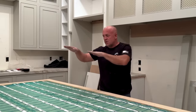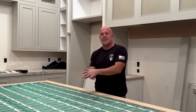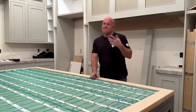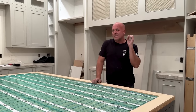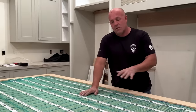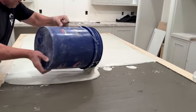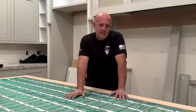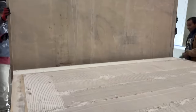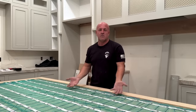We used two layers of half-inch plywood going across, and we staggered the joints so that we wouldn't have mud sneaking through or dripping through the seams. Then we ripped a four-inch strip and put it around the top, so this edge is now a full inch and a half thick. That worked out perfect because the granite we're using is 3 cm — we're doubling the edges to 6 cm, so an inch and a half is great. Now we need to put in a non-shrink grout, float this with concrete for thermal transfer. This is a giant solid slab of granite, and I need a good thermal transfer, so I'm going to set the granite to this non-shrink grout base so we have direct cement-based product to cement-based product for thermal transfer all the way through the granite.